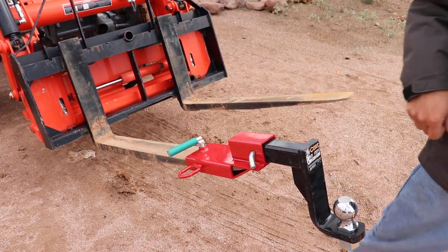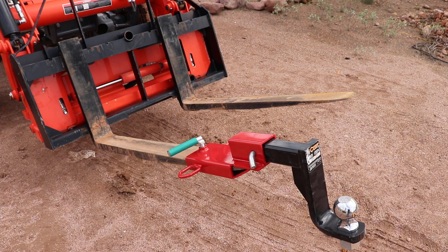That makes it really convenient and easy to take on and take off. You're not having to unscrew a ball if you put it through your pallet forks. Or like some people do, put the ball through and just leave it loose — which I think is why you end up breaking the tips off.